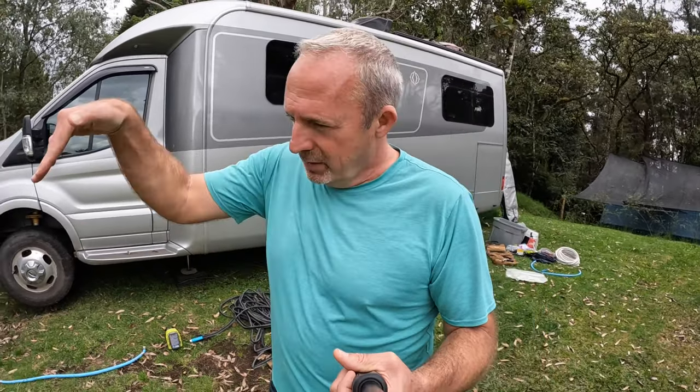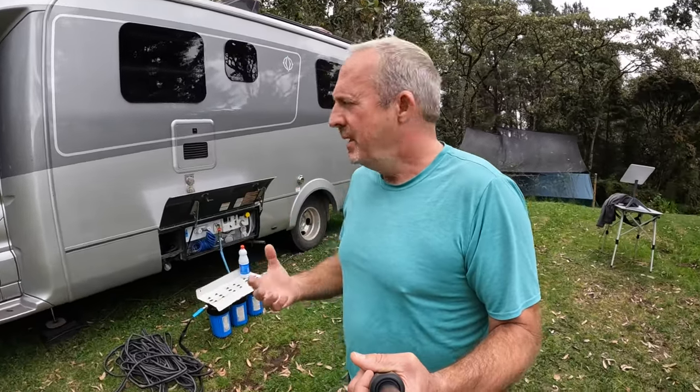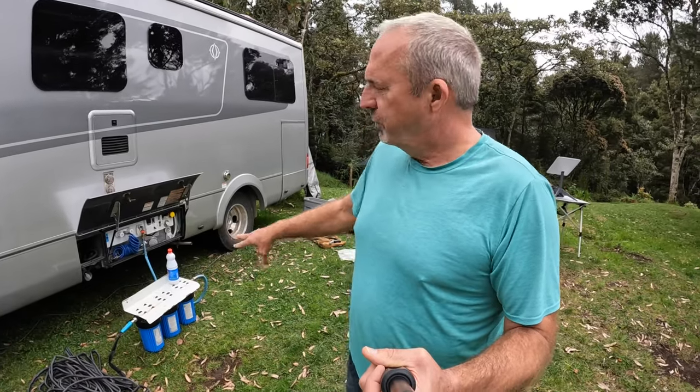So one thing to know about these Ryobi pumps, or any battery operated pump, is they do have limits in terms of their ability to lift water vertically. It took a lot of digging around and I found an unofficial number of its ability to maintain some pressure. It maxes out at around 35 pounds. I don't think that I would try and draw water more than 20 or 25 feet down to the river. It's just not going to have enough power to get the water up and then maintain pressure to get it through the filters and into the rig.